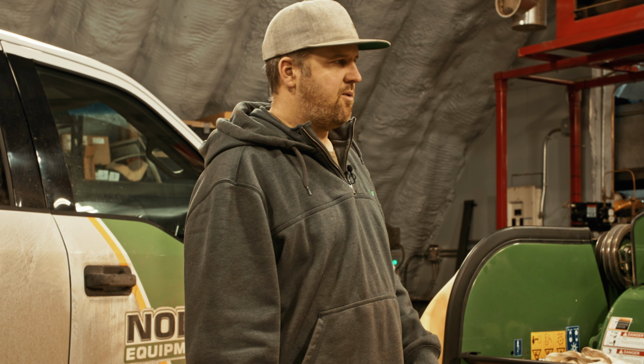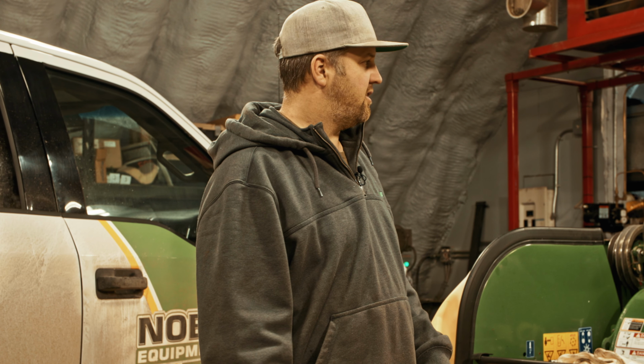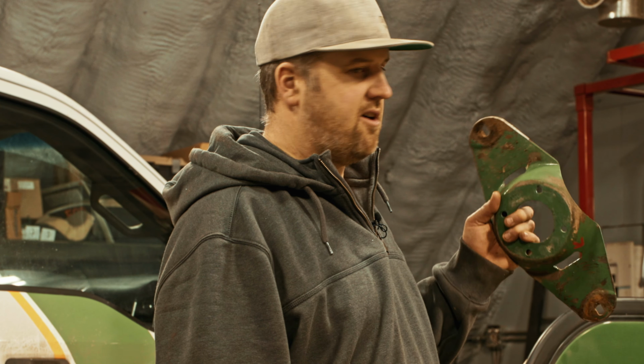Again, to give that winter check program a bit of value, I'm super happy at this moment that Tom was able to find a bearing where the flange plate bolts were loosening off, and it was gonna become an issue. If those bolts were to loosen right off and fall out, that was a very fast rotating part. If that would have come apart, that would have been a downtime thing, but that would have also caused a bunch of damage.